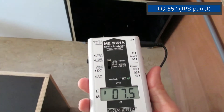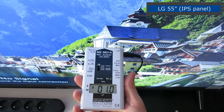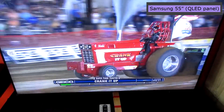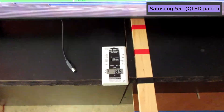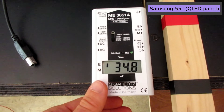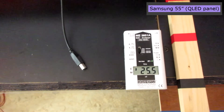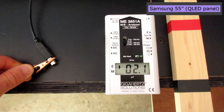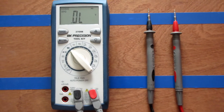Measuring with a ground cable, the values drop when closing in because the TV is now grounded. There are many products these days that come with a two-prong plug — this TV as well. On this TV, electric wasn't that bad, but it's better that this is grounded. I did this with a printer cable plugged into a USB port and then connected an alligator clip to it, which is connected to ground. This multimeter is set here to test continuity.